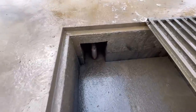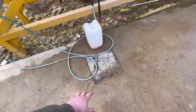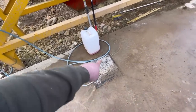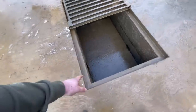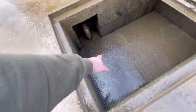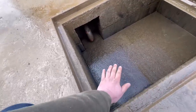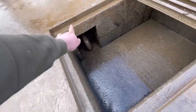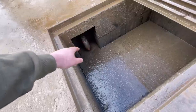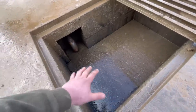This is the pipe into the soakaway — it's a 90-degree bend that runs up here. I also put a manhole in case we ever needed to clean it out, and it does keep itself pretty clean. From there it goes under into a big soakaway to let all the water drain away. The idea is all the soil and mud sinks to the bottom of the pit, the water level never goes above the top of that pipe, and the water runs up into the soakaway and disperses. When the pit gets full, we take the grid off and dig the soil out.